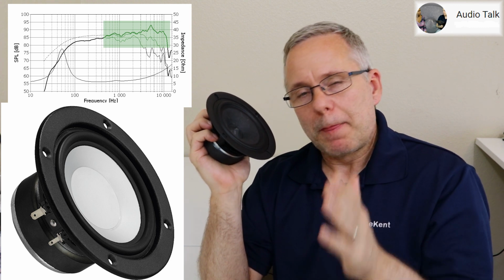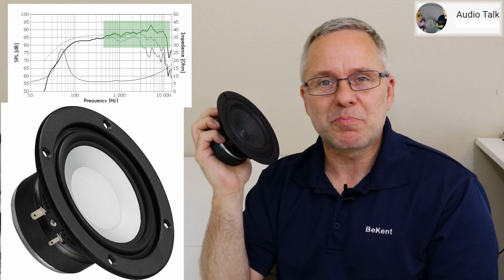Yes. Aluminum. I have quite a few things to say about aluminum. It's great, it's stable, it's light, it's really good at moving air, it's inexpensive, but the breakup sound of aluminum is absolutely horrendous. So my recommendation is don't use it over 400 or 500 hertz. Typically for subwoofers, it's great. I will say once you pass the 120 hertz mark, I tend to like the paper cone again, because then you can hear a little bit of that wooliness to the paper, and it makes it more warm. But if you're down beneath 80 hertz, I think you can make a really great subwoofer with an aluminum cone.